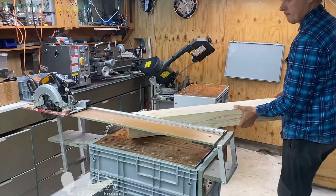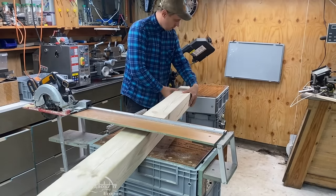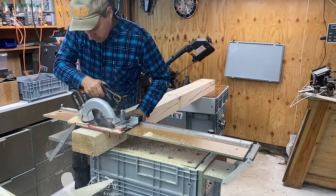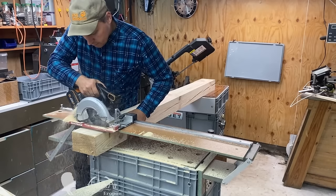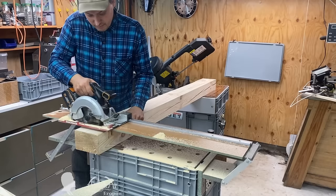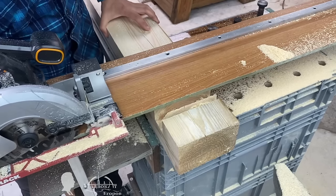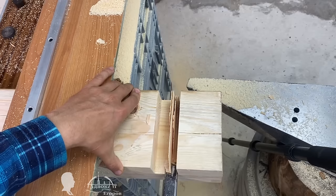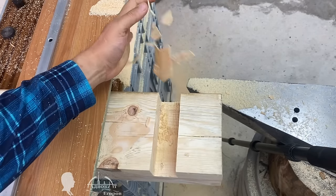Look how easily I can join a 50 mm (2 inch) block into a large beam. After making the end cut, I can quickly and accurately set the cutting depth right on the spot. After laying out the workpiece, I can mill the groove in the beam with a circular saw, which unlike a router can easily cut through large knots. The cutting area precisely coincides with the edge of the guide rail, which facilitates the saw's positioning, while the perpendicular stop ensures a 90-degree angle. I usually remove the remaining wood pieces with a chisel, but they are so fragile that they can be easily crushed with my fingers.